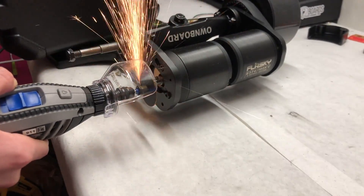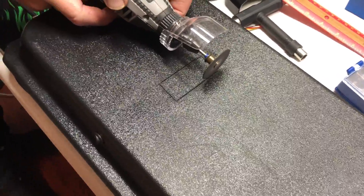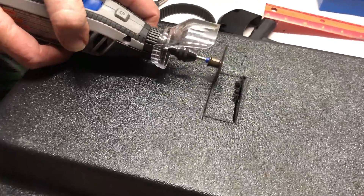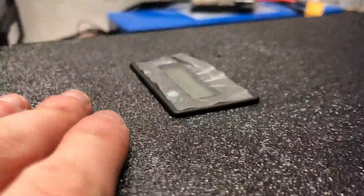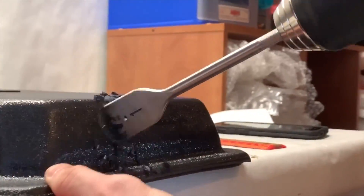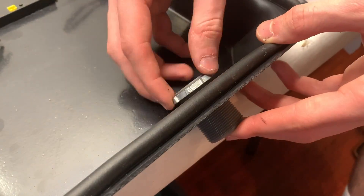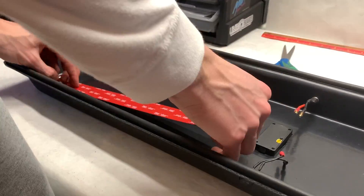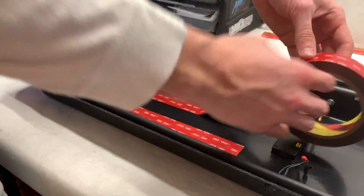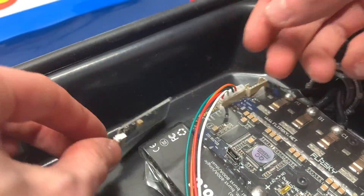As mentioned earlier, the belt cover was not fitting, so we finally bought a dremel and sawed off the edge of the motor shaft. We then cut the hole for the percentage indicator — the dremel sped up the process quite a bit. The percentage indicator hole came out much cleaner. We drilled holes in the rear of the enclosure for the phase wires to pass through, sized to fit electric conduit fittings from Home Depot, which prevent water from getting in while riding in damp conditions. To mount the battery inside the enclosure, we used double-sided sticky adhesive.